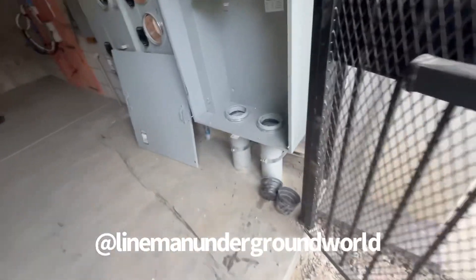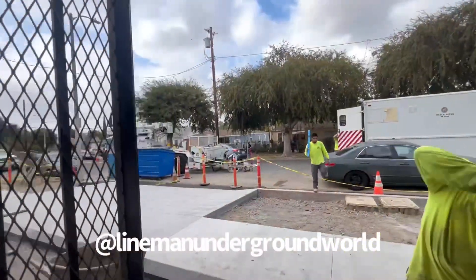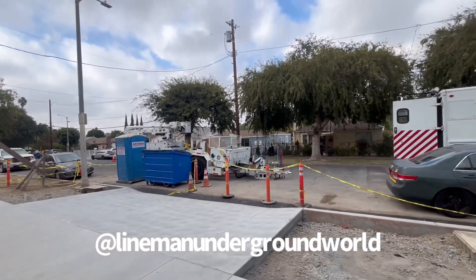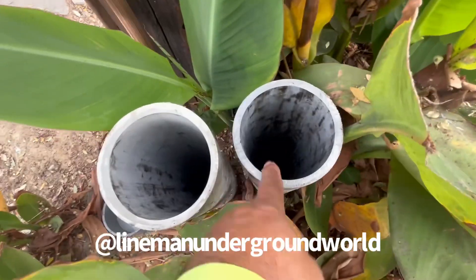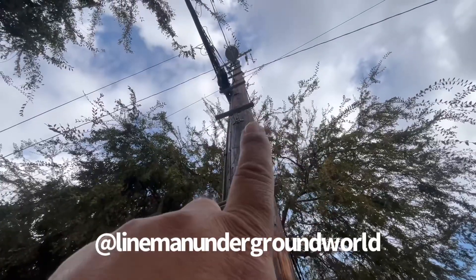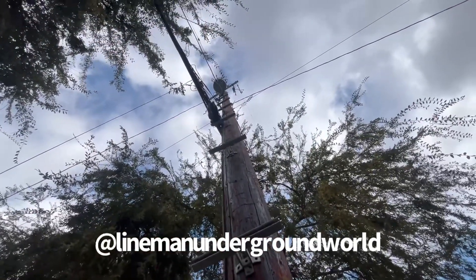There's no string in the ducts, so we attempted already from here that way. But we found out that there's four 90s, so we're going to try from the other side. If not, we've got to call the dirt dogs. Stand by — we're going to attempt this one street side because that communication conduit is over too much, so we don't want to be angling the conduit as we pull it.